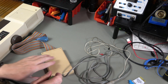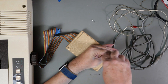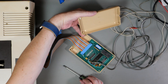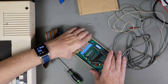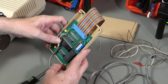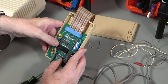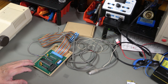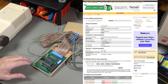So I've just got four Phillips head screws - quite small, so I'm using a small screwdriver. Inside we've got a P8048, an LS244, an LS373, a bank of DIP switches, and an 8404TR. After a little adventure with Google, the P8048H is an Intel microcontroller.